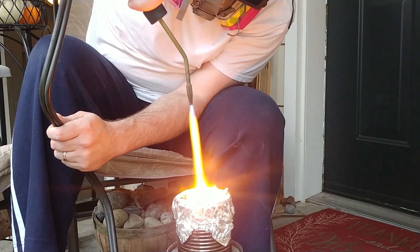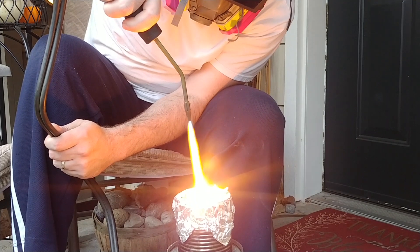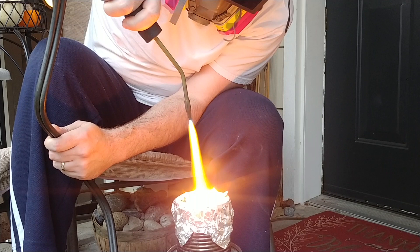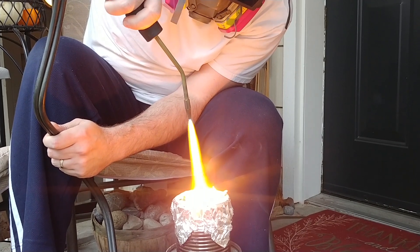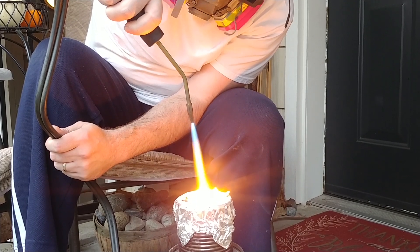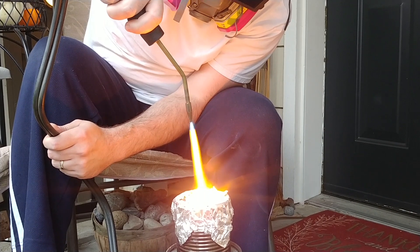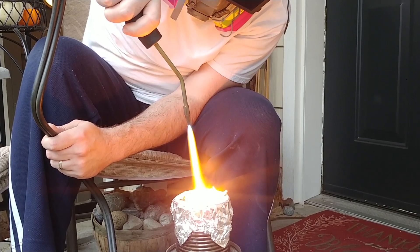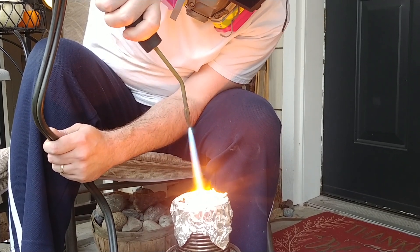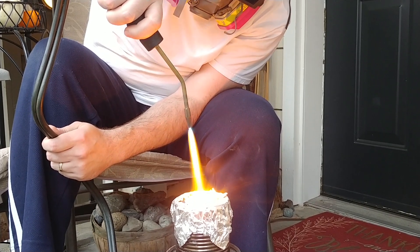This flame is not wanting to cooperate, but I'm trying to keep the top here right in the spot where it's able to stay in a semi-molten state. That allows the crystal of the corundum to form an actual lattice, so it's not going to be just slag — it'll actually be crystals that we'll be able to verify through the microscope.